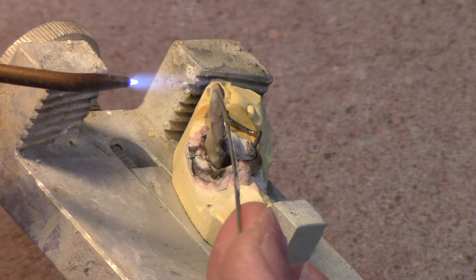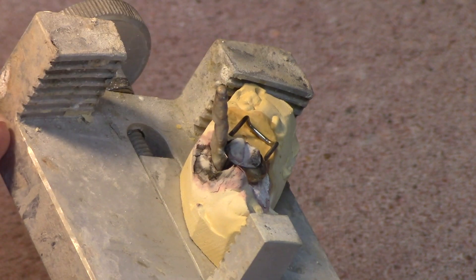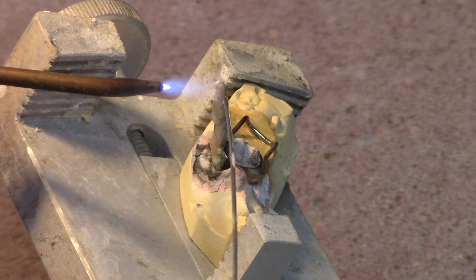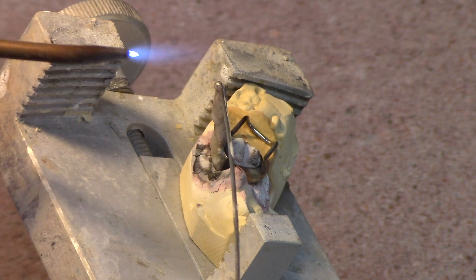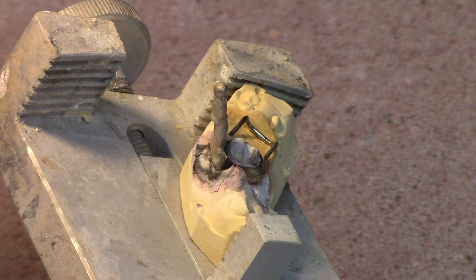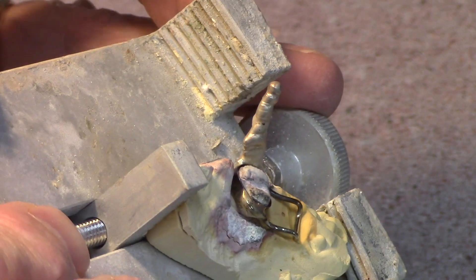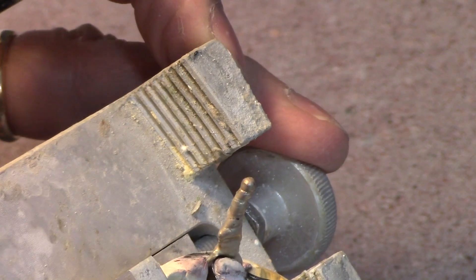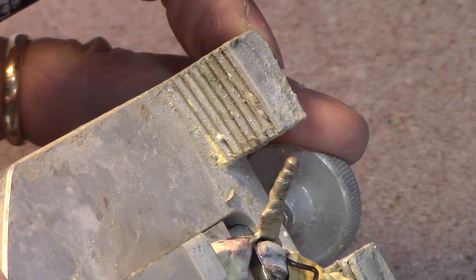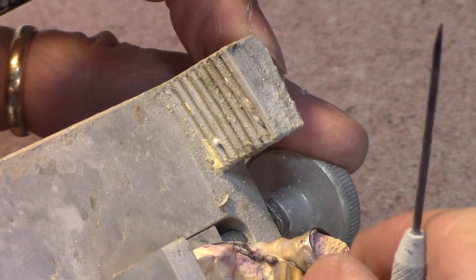Subscribe and you'll be notified when the new video comes out — click on that little bell thing and it'll give you a sound on your phone. But there you go — you see what I'm doing. It's just heat control. Once you wet the solder joint, you've got the strength of the solder joint. Then you just melt solder on top of that, and once the solder melts into the solder — you can see here, that is solder melted into solder.